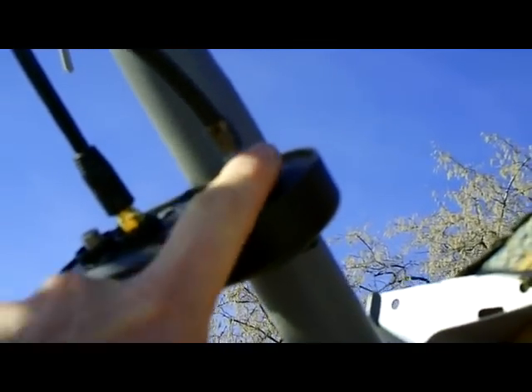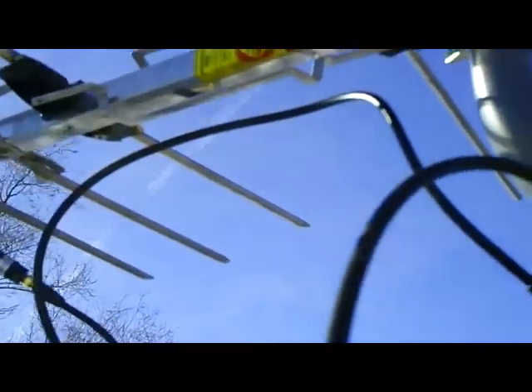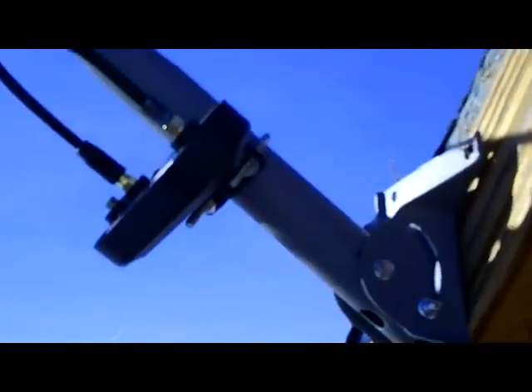I would also be careful when tightening up these connections because they seem to be a weak point — if you wrench on them too hard you might bust one off. Other than that, it's a pretty straightforward connection. I'm going to route this wire over here against the cabin and wrap that insulation around those wires to reduce interference. I can already tell you I've already got over 30 additional channels as a result of that booster. It uses an extremely small amount of power and really boosts up the signal excellently.